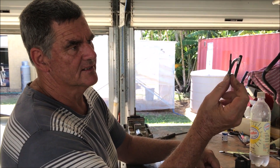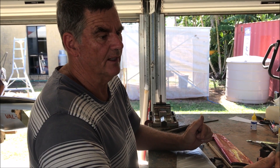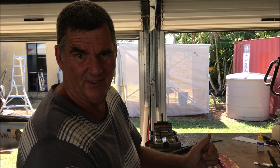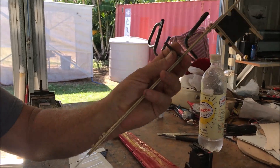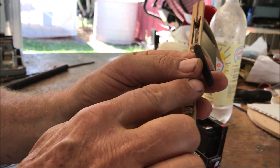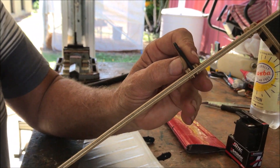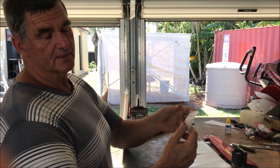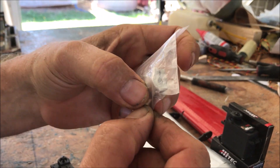You get sheets of two-millimeter compressed carbon sheet off eBay and we cut that on the CNC router. We did experiment with aluminum hinges, which seemed a good idea at the time, but we found it wore very quickly. The hole elongated very quickly with an aluminum hinge against a steel pin — not a good idea. Now everything's made from carbon sheet and we've had zero problems.